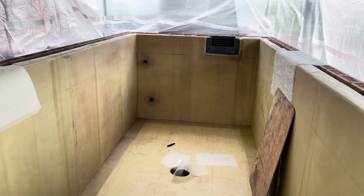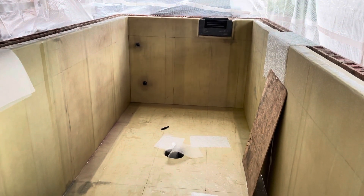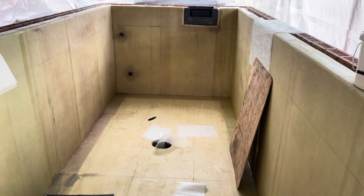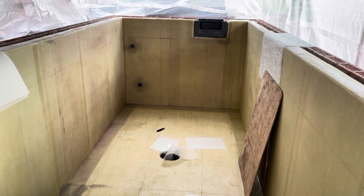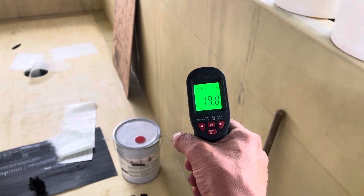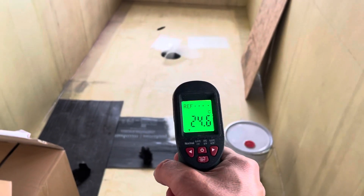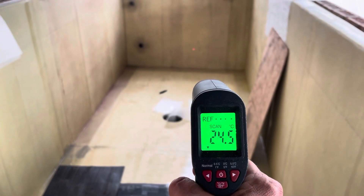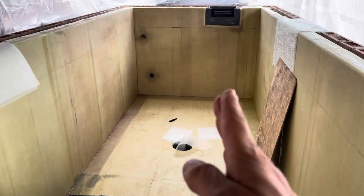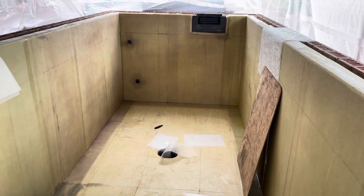It's going to fall on deaf ears to the people that make this - they're not going to be interested. But my god, don't fix what ain't broken - 30 odd years. Temperature-wise, it's not overly excessive to be glassing in 20 degrees; in fact it's dropping as I speak. So you've got 19 ambient room temperature and then 24.5 on there. The exotherm is building up because the heat generated within the resin cannot get through that foam - despite what somebody misguidedly said on somebody else's video one time, but that's another story.